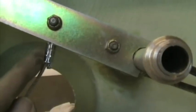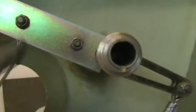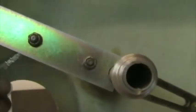These cables have been swaged and all the bolts have been torqued. As you can see, there's free movement there due to the bush that has been put in. That backing plate for the horizontal stab attach pins is bonded in place.